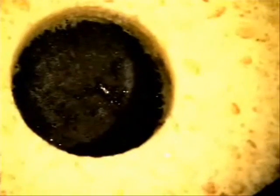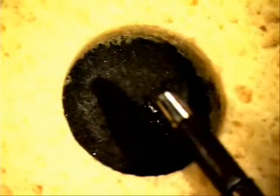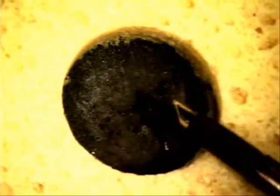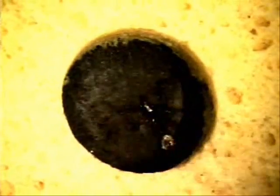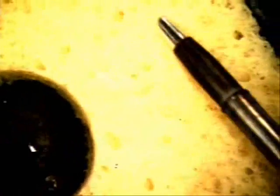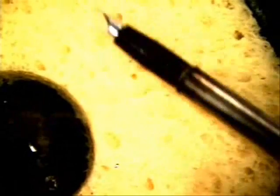Okay. The first thing I do is I dampen a sponge. And here's my little sponge. It comes with a nice little cleaning handpiece holder. When I'm cleaning, I gently wipe it into the center of the hole, just like this. That puts all the solder into the center of the hole with no problems, and so when I go to the outer edge and finish cleaning it, again I have it almost parallel to the top of the sponge.